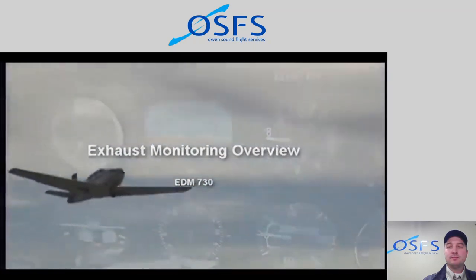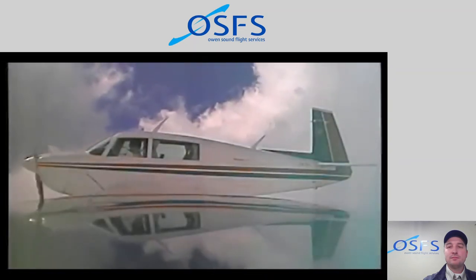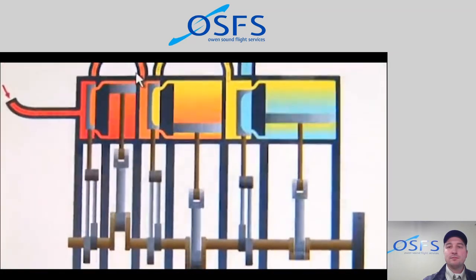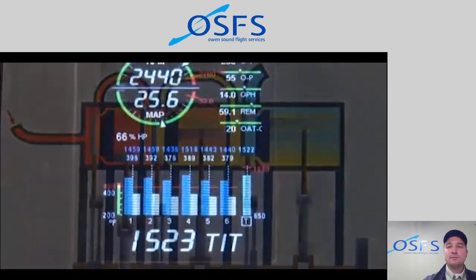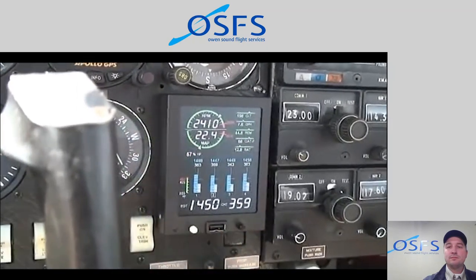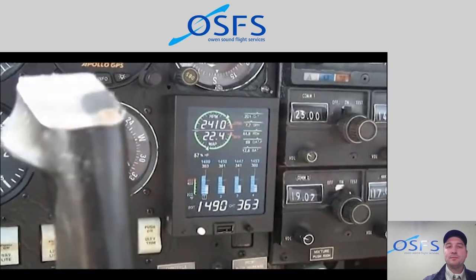When you fly your piston aircraft, only a small percentage of combustion energy actually moves the piston to produce engine power. Most energy passes into the exhaust pipe as very hot gases. Monitoring the temperature with your EDM will indicate the quality of the combustion process and allow you to troubleshoot potential engine problems quickly.